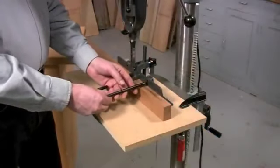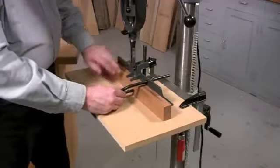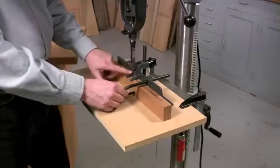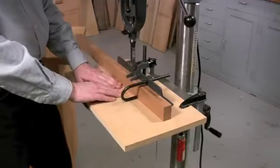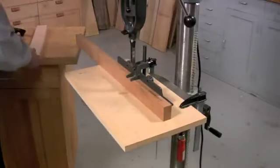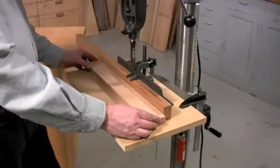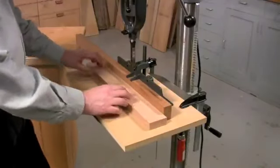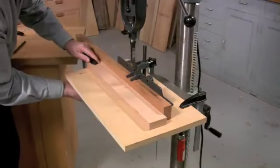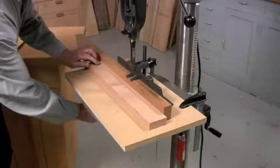The accessory sets come with these U-shaped rods which are meant to snug the workpiece against the fence to keep it from moving back and forth, just like we've used the hold down to hold it firmly against the work table. But rather than use these, I prefer just to use a board with a jointed square edge. And I just clamp this in position at both ends, once I've snugged it against the workpiece and the workpiece against the fence.